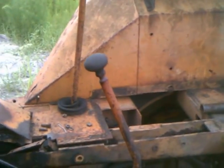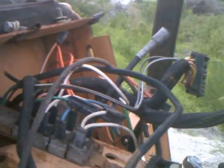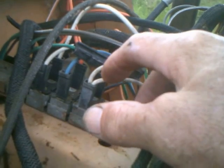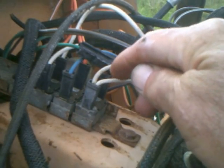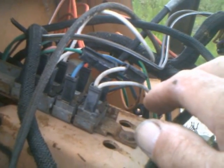So it's a matter of getting the master cylinders in, bleeding the brakes out, and getting a couple of electrical problems fixed up. I'm trying to remember what number breaker this is — this breaker right here is not functioning. I'm pretty sure it runs the fuel gauge, which isn't working. It used to work, it doesn't work now. This breaker's not working, and this breaker isn't working — this is a 15 and this is a 40. I think we'll be in pretty good shape. It won't be everything fixed, but it'll be much better than it was.